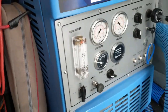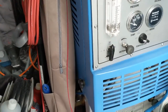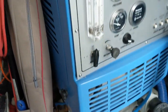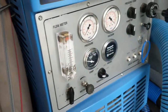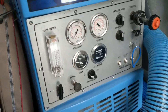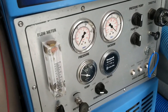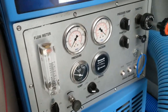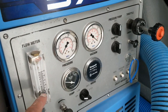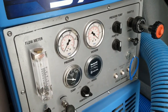I've got a quick fix suggestion if you're having problems with your flow meter. If you know it's not worn check valves on your chemical pump, and you know there's no hoses or loose fittings on all the rubber hosing involved, and you just can't get your meter ball — the float — to come up where you want it. What mine's doing right now is it barely moves; I've got to open up the metering all the way to get it to come up just a hair.